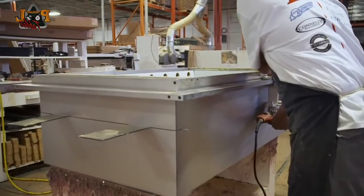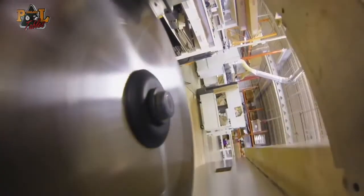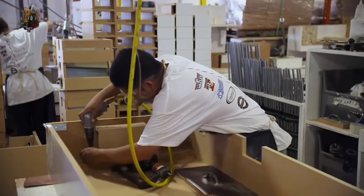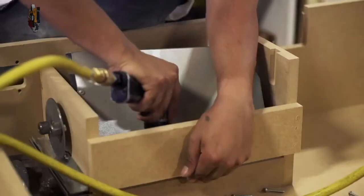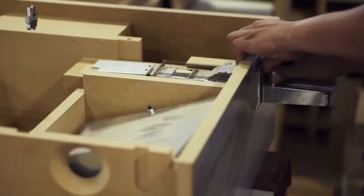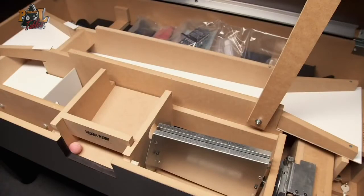We do that so that when you put the hinges on and fold them down, the two halves match up absolutely perfectly. The table is buzzed in half to give operators access to the internal components. These are dropped in at this stage: the ball trap, which is the part that releases the balls to the player as he inserts his money, the coin mechanism, the turn ramp, the center ball return — that's all assembled into the bottom half.